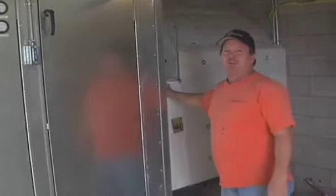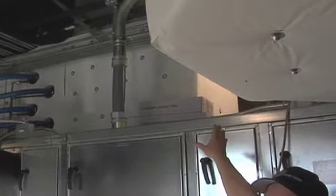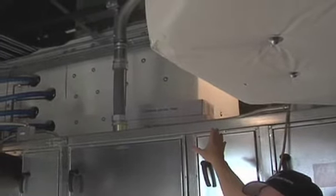This is the return. This is what pipes to all the returns that we saw through your building. The first one's near the door. It basically goes up in a big square, taps off to all the little ducts. The supply air is this duct up here. The metal part up there is a sound attenuator, so it's not so noisy when the airflow goes by.